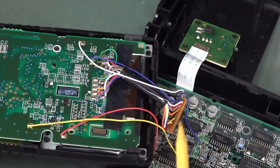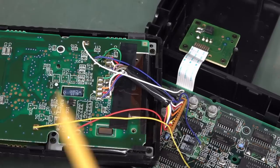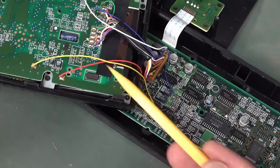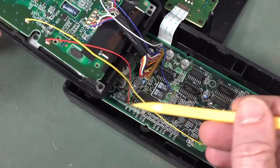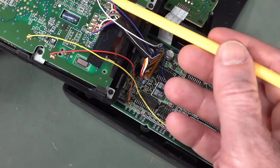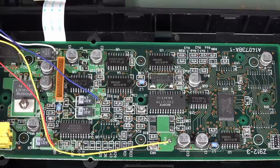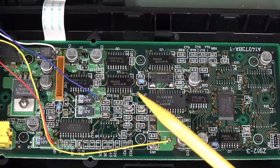They've used a connector over here just to aid in assembly. The red, yellow, and blue wires here are just ground connections going to this grounding pad - not through the connector. That's an afterthought - they had some layout or EMI issues and needed to join the grounds. And absolutely no surprises finding a couple of Sony parts in there. There's an interesting NEC part with a denser footprint - it's a 256 kbit static RAM. They're using that to bitmap all the stuff - it holds the bitmap image for the screen.